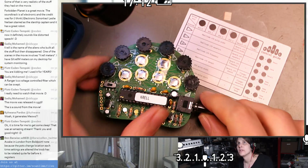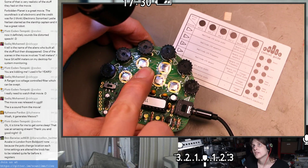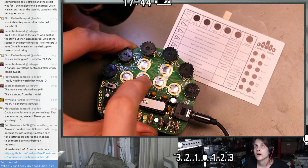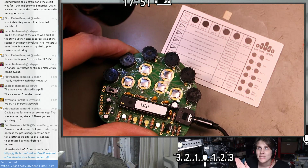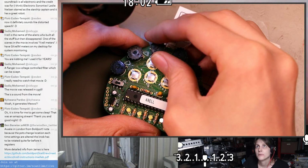Oh, okay, so I was wondering how that works with the knobs. I guess, so this is Ben from Boldport. The mental model that I was starting to come up with for the knobs was based on one of the ways that I'm used to MIDI controllers working, which is where when you switch modes, the software has some other notion of where the current position is for each control that is no longer going to match the actual physical knobs. And so there are different ways that the software works around that. One that I've seen is, let's say you turn the knob, it will make the relative motion take effect immediately in that same direction. But if you hit the edge, then you get stuck and you have to go back the other direction and then try again, with more room ahead of you. I thought I noticed that happening, but maybe I was misinterpreting the signals I was seeing.